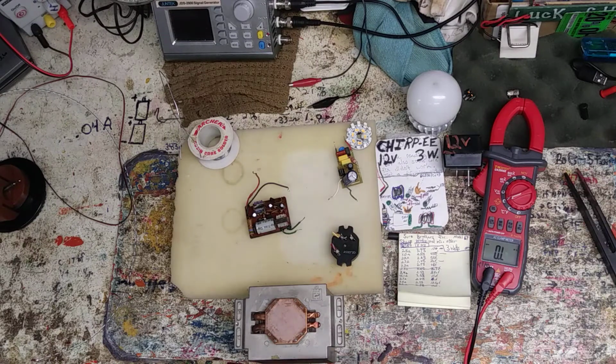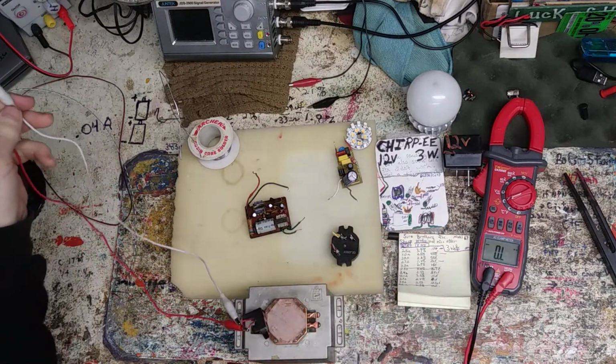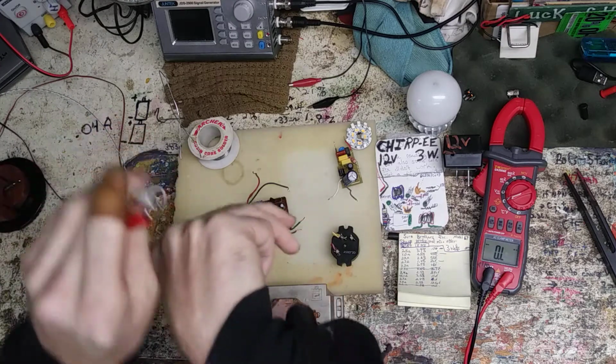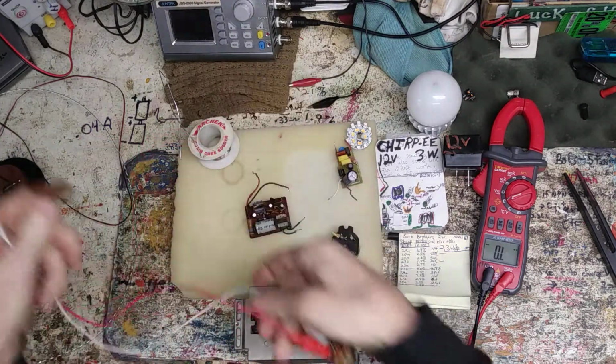Yeah, even this buzzer's open, so I guess that's how they are till they get voltage through them, then they vibrate. So that's pretty much how they work, they get a pulse through them and it makes them buzz. The higher the hertz of the pulse, the higher the pitch. Young kids' hearing tops out at 20 kilohertz, and for older folk it's right around 10. I was messing around the other day, and the highest I could hear on my signal generator was 12.